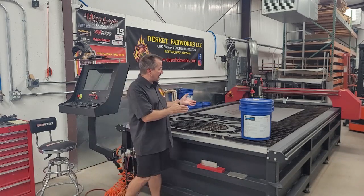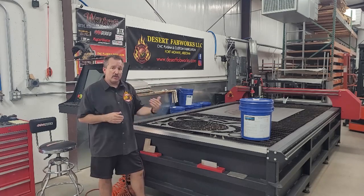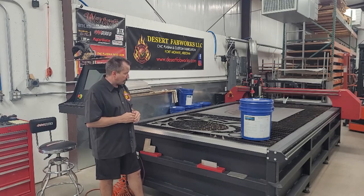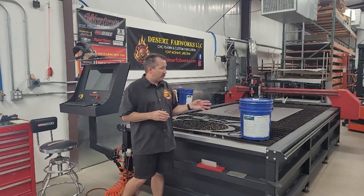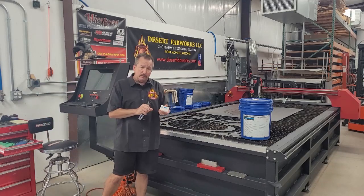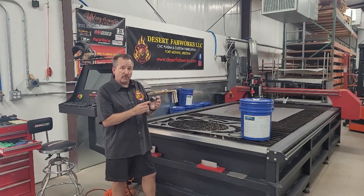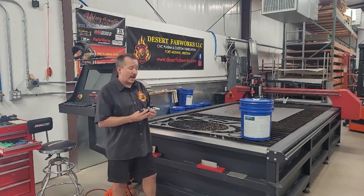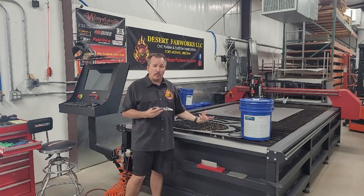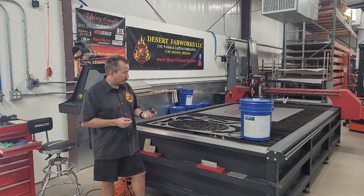With this table's setup I don't have to replace the Sterling Cool — I just continue using the same batch and add a little bit as time goes on whenever I add water, keeping everything balanced. I check the concentration in a couple of ways: I use pH paper, which you can get off Amazon cheaply, and a refractometer. You put a couple drops on it, look through the viewfinder, and it gives you a concentration reading — a very accurate way to make sure your solution is still where it needs to be.